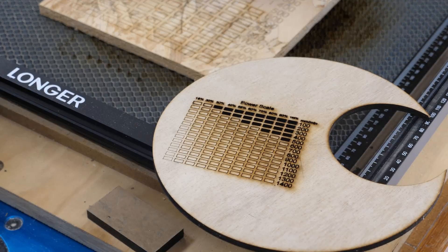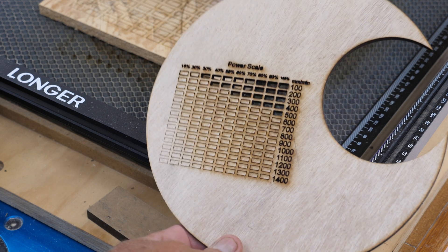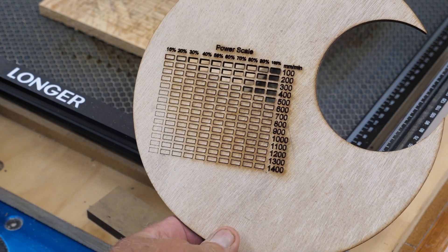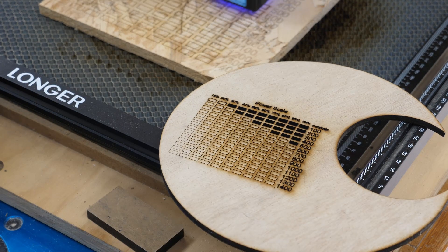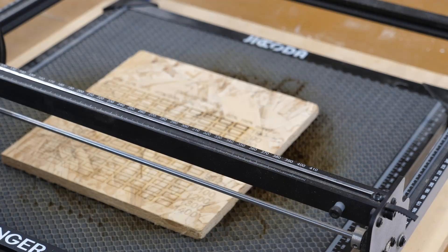You don't need to make it as big as I'm making it here — I'm doing that for illustrative purposes. Here is one from a different laser done on a quarter-inch Luan underlayment plywood. As you can see, it tells me where my best settings are. There it is as the scale is made. When it got into the higher power and slower speed, there's a lot of scorching on there, so if you're doing line engraves you definitely wouldn't want to do that.